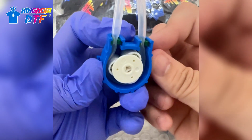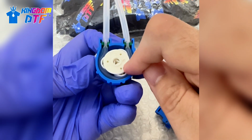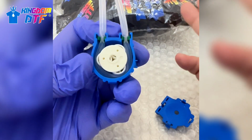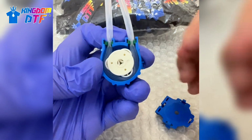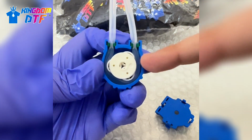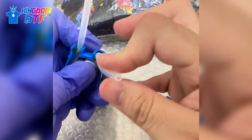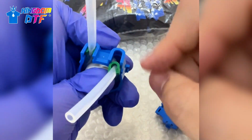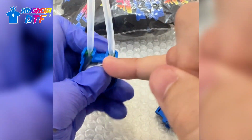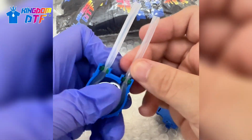So when you got a leak, you need to replace the tubing. As you can see, you can take this part out. You're going to remove this one. I don't want to do it right now because, to be honest, it's not difficult, but at the same time, you need to have time and patience to remove this and put it back, okay? So you're going to remove this disc over here and the 3 wheels, and this has got to be empty, and then you can actually remove the tubing. As you can see, you can pull it and remove that from there. So make sure you keep all these small parts. Don't throw them away or lose them, because then it's not going to work really nicely.